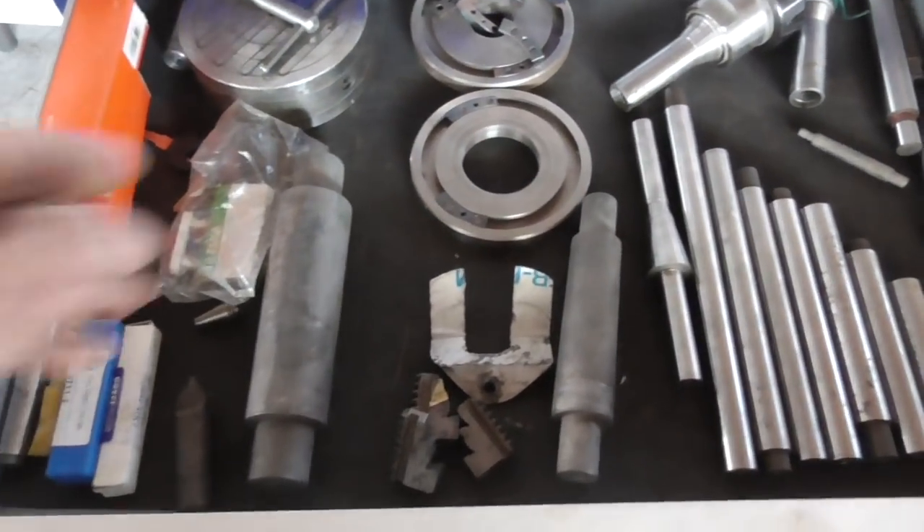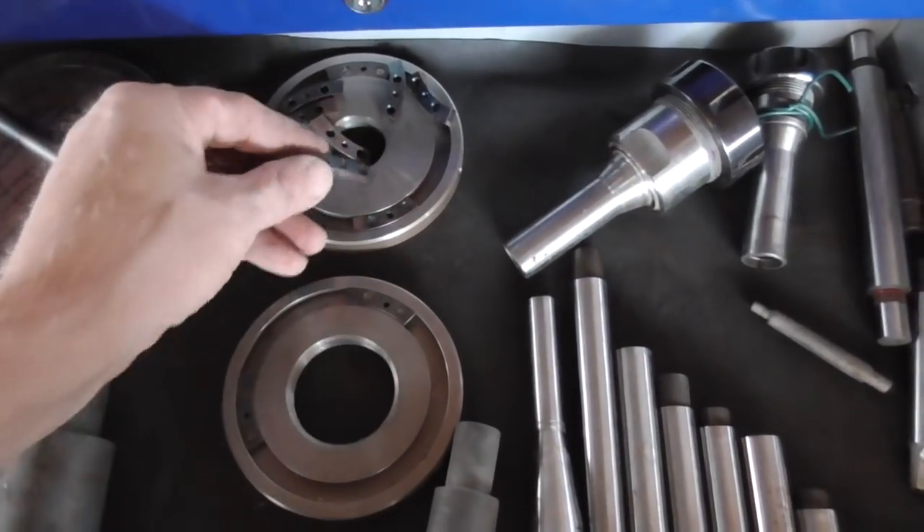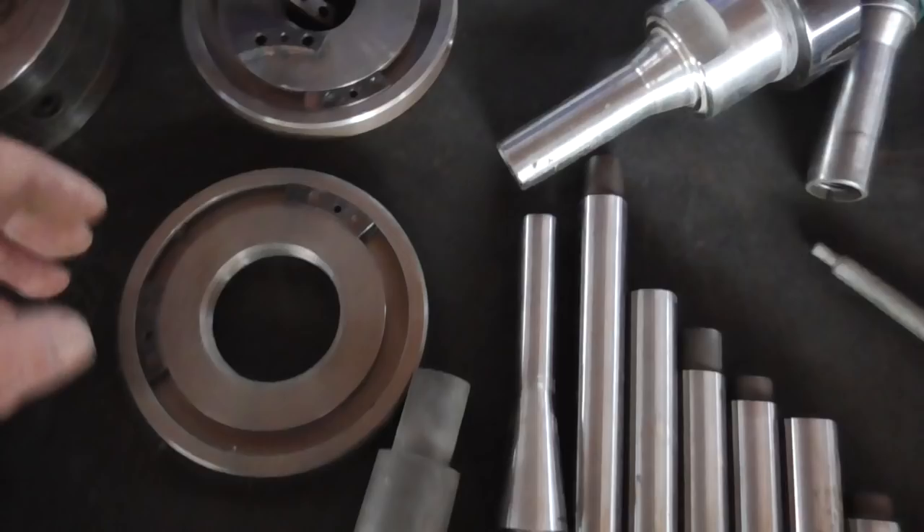Now to the wheel adapters. The MyFord came only with two of them and that's certainly not enough, so I had to make a bunch myself. Here's one of the nuts. You need a balancing weight or two. I thought about how to improve the clamping of the weights. The circular groove visible from the outside diameter is slightly tapered so the weight doesn't slip out by itself. The two outer bores of each segment are bored for magnets to be glued in — so with good quality magnets, that weight will never fall out and will not slip by itself.